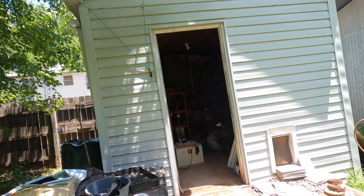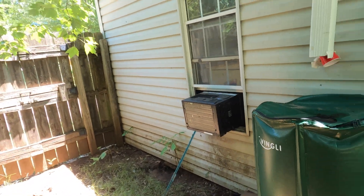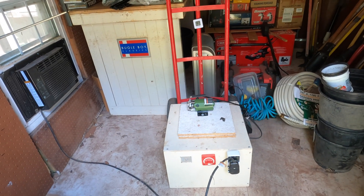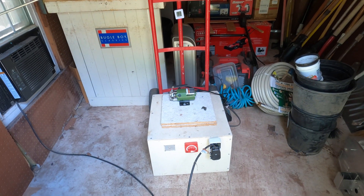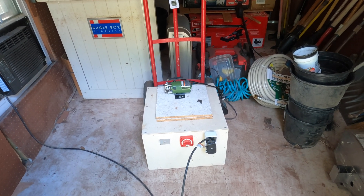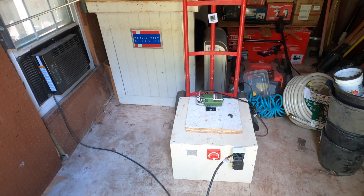This is my potting shed, and it's unique because it has a small 5,000 BTU air conditioner. Today we're going to see what it takes and how long my DIY power station will run it. The building is about 8 by 10 with some insulation. It's 95 degrees outside. I have a 100 amp-hour, 24-volt DIY power station with a 1,200-watt inverter — a very nice setup. The question is: how long will this run?